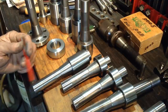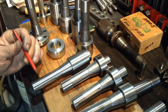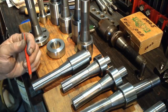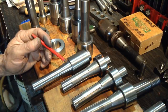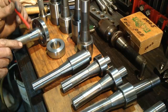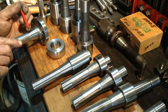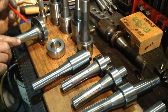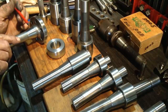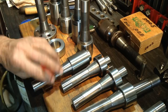Okay, with the roughing wheel, we've completed the grinds on all of the small ends of the R8 arbors. These we've ground to 1 thou above finish size, so we'll take that last thou off with the finer wheel. So what we're doing now, we're onto these tapers. This is the first one I've ground, this is the second one. I've ground this one, had a check, and just done a very slight adjustment on the angle. So we've moved our compound 2 thou, well, we're at 2 thou in the position where I've got the indicator set up anyway. So that's a very minute amount. So we'll recheck.